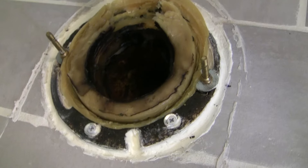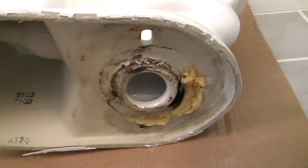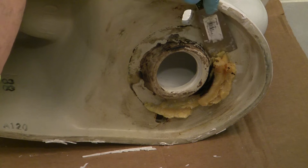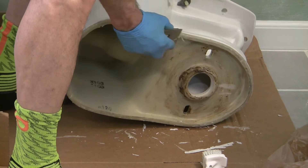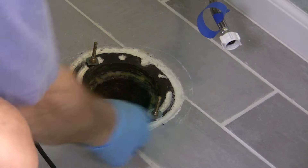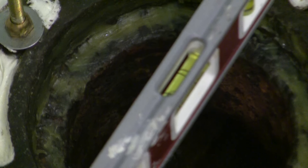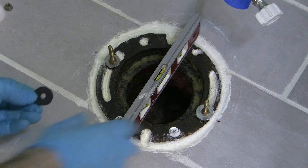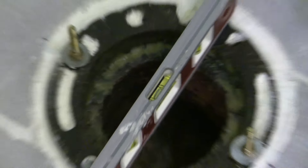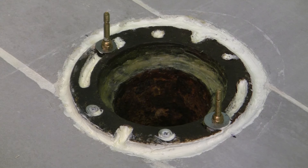There's the bottom of the toilet with wax stuck to it — it was all intact, all fine. I'm going to scrape all this off and start over. I definitely used too much caulking last time, so I won't do that again. I'm still left with the out-of-level flange problem. I found that a little rubber washer will fix it — it's an eighth of an inch — so I'm an eighth of an inch out of level. There are also some deep pits in the iron around the edges, so I'm filling those in with wax.